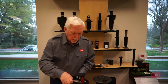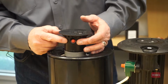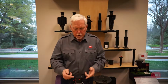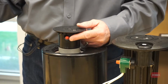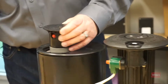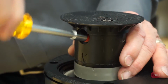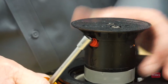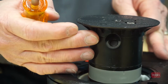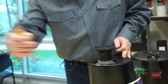Okay. We also offer on all of the part circles a series of back nozzle positions. The front part of the watering arc is going to be the primary, but if you have some vegetation growing behind the sprinkler, to avoid having to put another row of sprinklers out there, we can remove the inner nozzle plug and replace it with any of the inner or intermediate nozzles that are going to throw water right out the back. Now, an inner nozzle in this position is going to throw about 25 feet and put good water close out to 25.